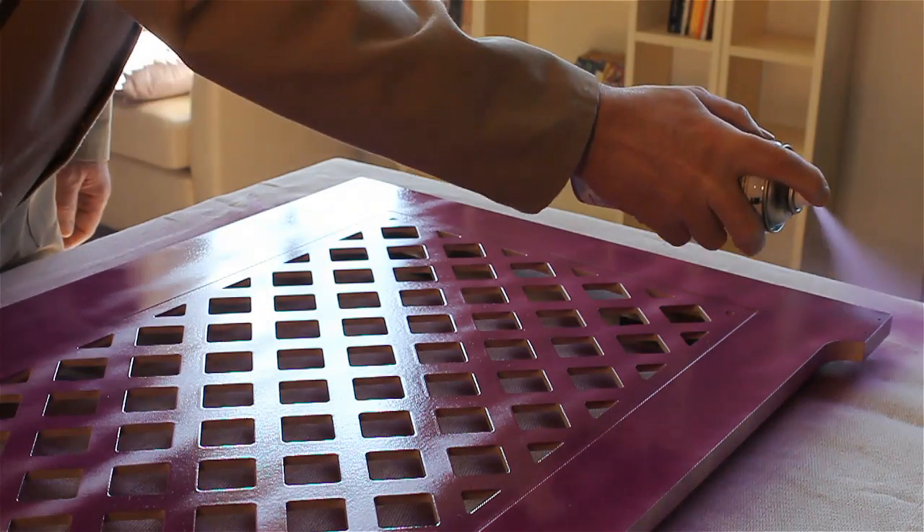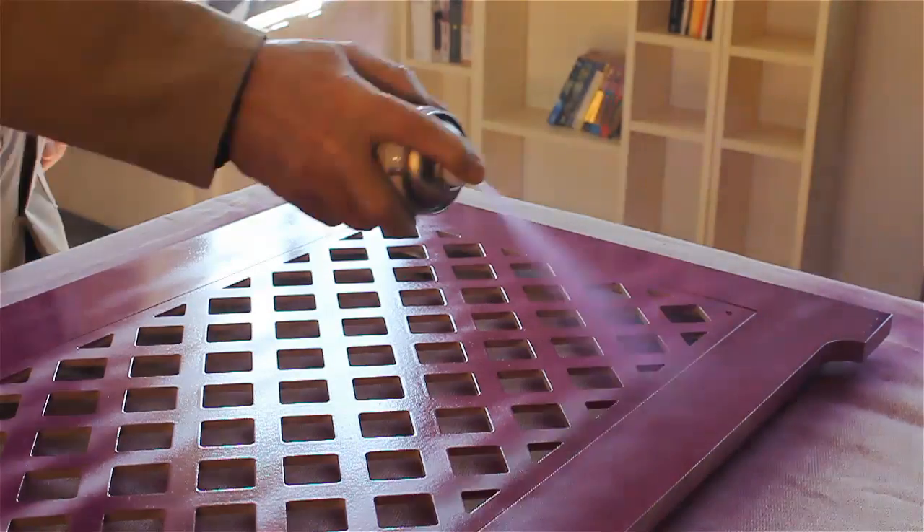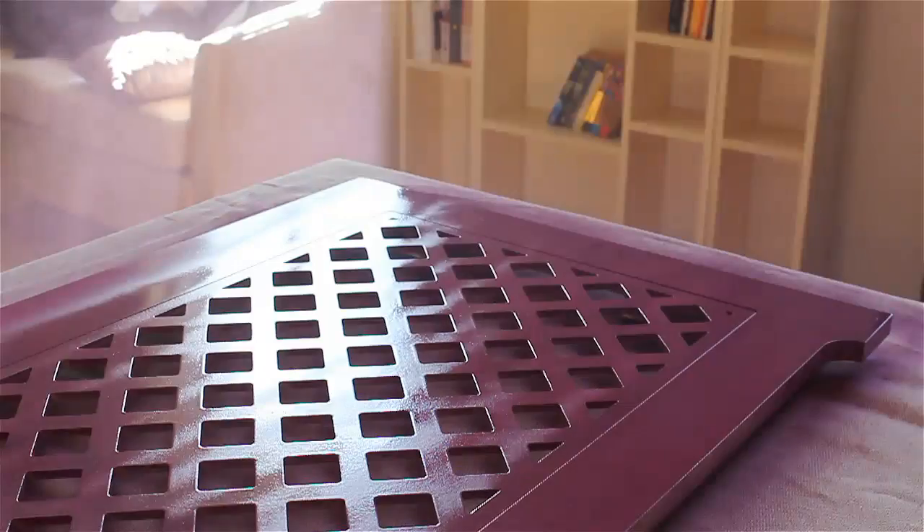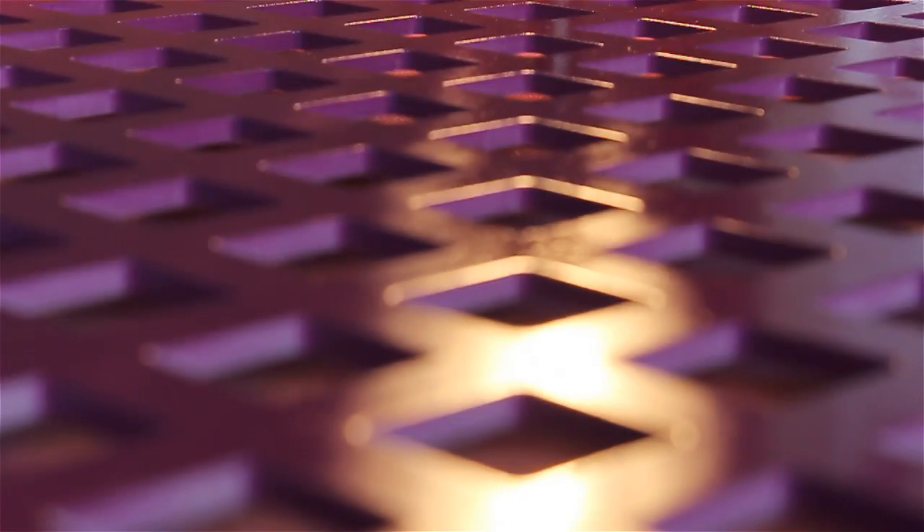To fully paint fretwork, we do four coats: two in opposite directions on the first side, and two in opposite directions on the second side, but at right angles to the first side. By working this way, you will see it covers the edges of even the most complicated fretwork patterns.